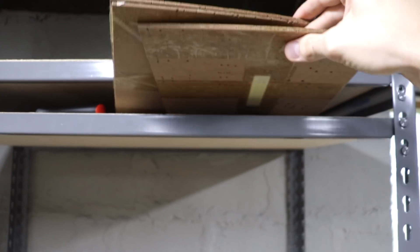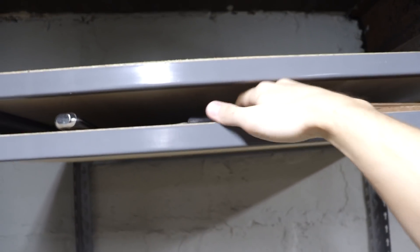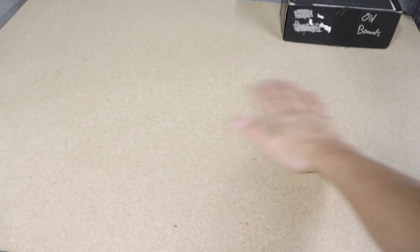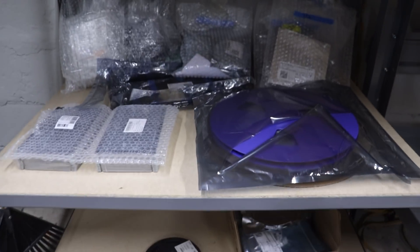The ring lights are a little more flexible because we're pretty much just populating addressable LEDs and a couple of passives, so it's not nearly as important. But for the motherboard, I think we want to get a nice jig. This whole shelf is just for solder paste and SMT storage. Up top we have storage for the extra stencils and some tools like the squeegees for applying the paste. Everything underneath is storage for SMT components for the ring lights and for the motherboards.